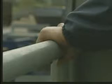A Marathon system which uses a covered hopper is recommended. If it is necessary to walk out onto the compactor, be absolutely sure that your unit is equipped with walk-on tread plate or diamond plate and has hand and toe rails on each side for protection against falling.